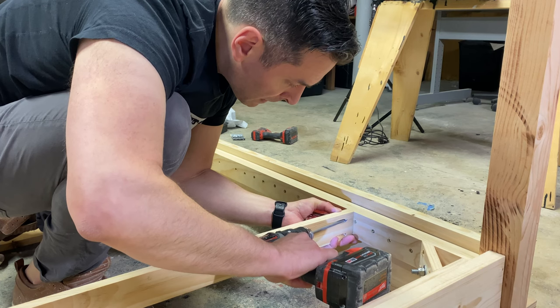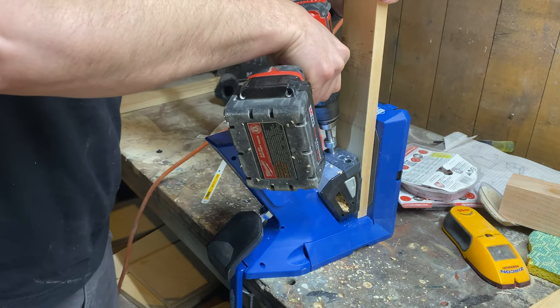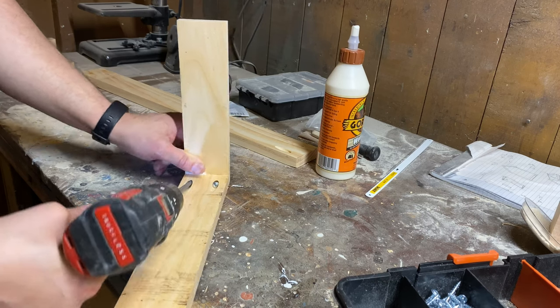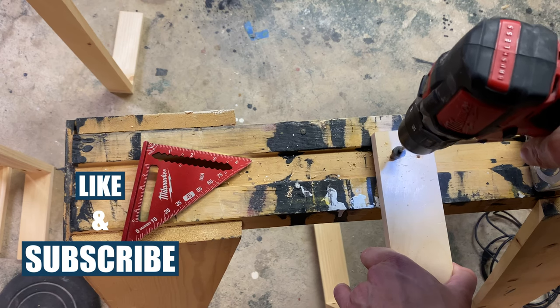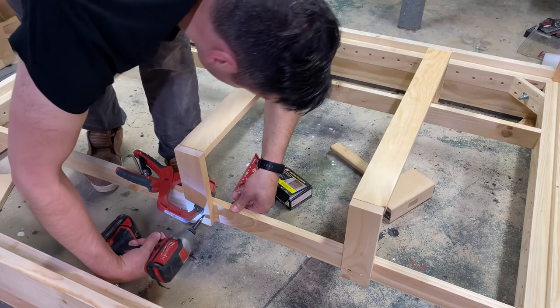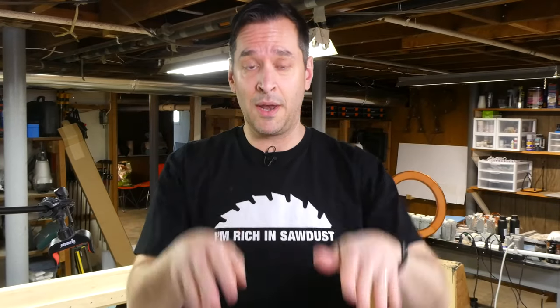What's great about the mat basket is that it actually adds additional support to the table foundation. Before I start staining, I have two things left to do: I need to start working on the tabletop portion, cutting down a piece of four-by-eight plywood into two-and-a-half by four-foot lengths so the tabletop will be in two sections. And I need to attach some ledging to the interior of the table so the tabletop has something to sit on.